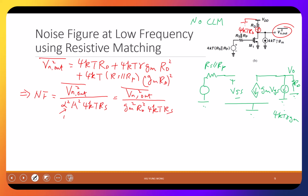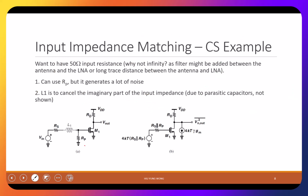I'm wrong. What did I do wrong? Very wrong. It's about the alpha. So I'm sorry. This circuit looks like the case, but this is the simplified case that we use for the noise calculation. Isn't that we're talking about impedance matching? We actually add Rp so that you match the impedance. So the voltage sensed by the here, what is this voltage here? Vx equals to V in times what? Huh? 1/2, very good. But let me don't call it 1/2 yet. You are right. This potential divider, right? Which is equal to 1/2 if it's matching Rs equal to Rp.